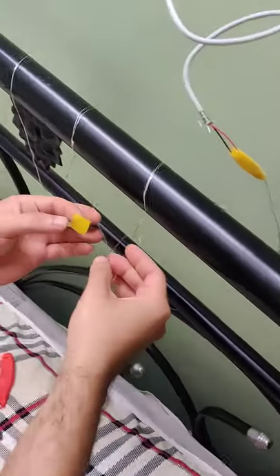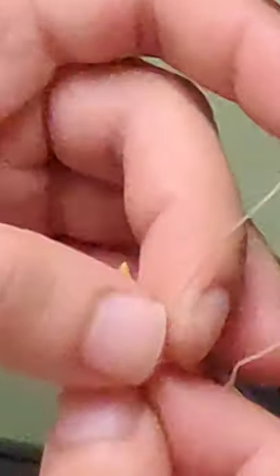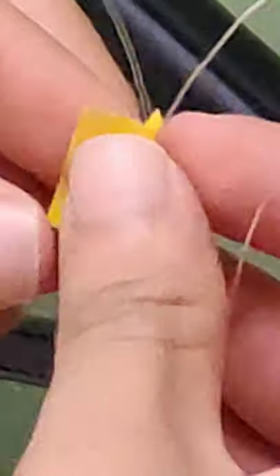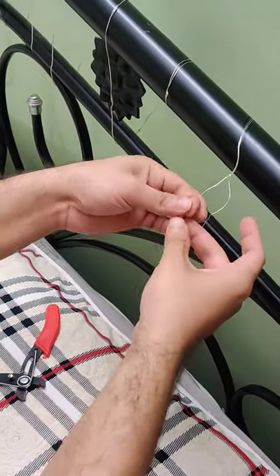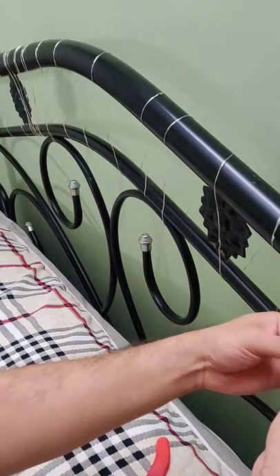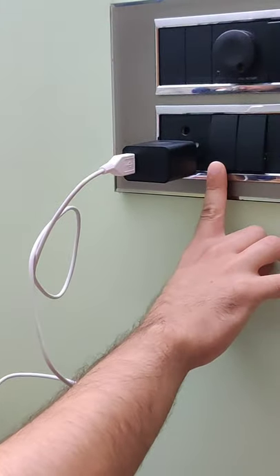It's perfectly safe, but it's always a good idea to put on a little insulating tape on the edges since these are now conducting and exposed. Although you can't get a major shock with these fairy lights — since I'm running them through an adapter which is only five volts and two amperes, even if you do get a shock it'll be quite minor — it's always a good idea to seal any open or exposed parts of the wire. And hopefully when we switch it on, it should work.